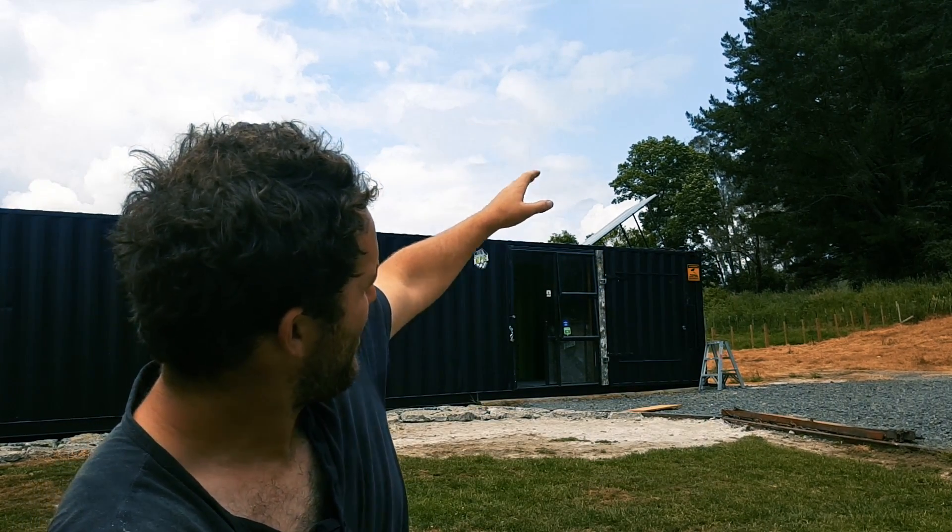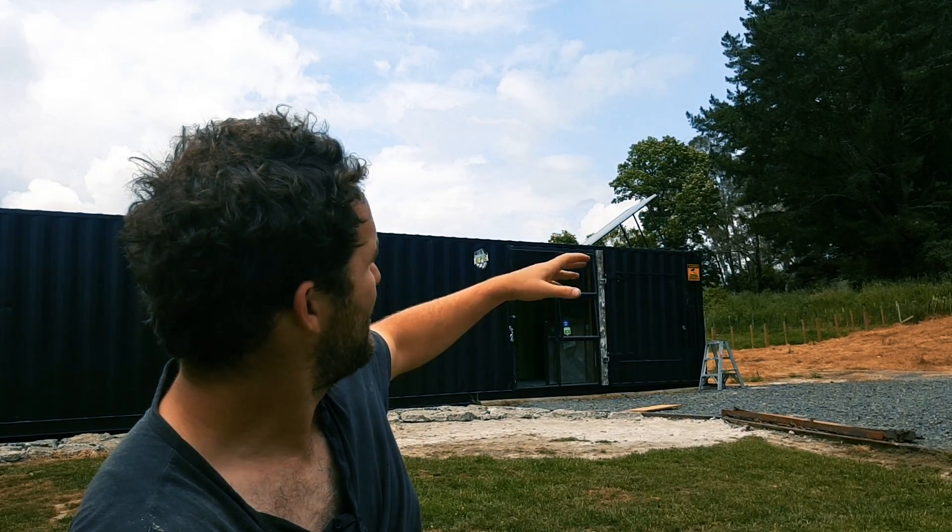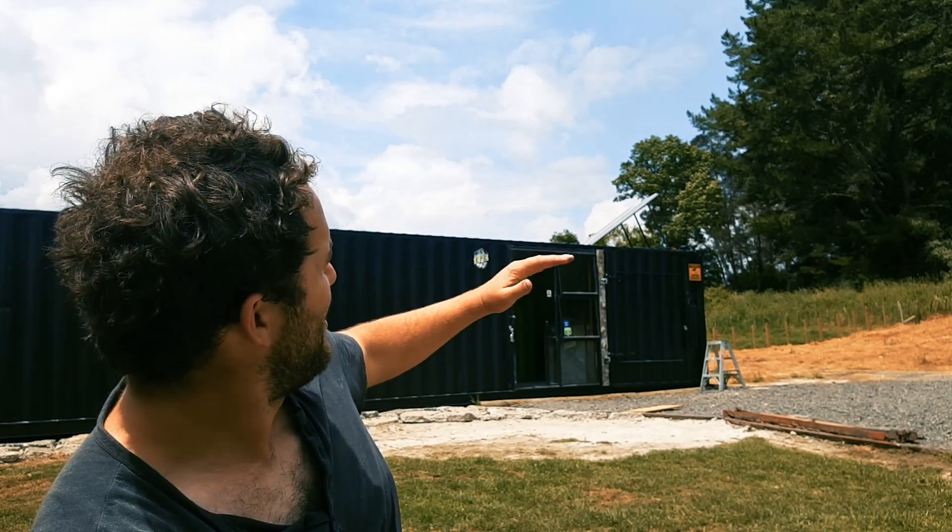Another thing I really had to figure out is the angle and position of the solar panels. The back arm can be removed and changed for different seasonal angles. Here in New Zealand there's a big range between winter and summer angles because we're so low on the globe. My container is oriented about 32 degrees off north, so I had to position the panels a little bit skewed — but it actually looks quite nice. I'll put a link in the description to the website I used to figure out the exact angle.